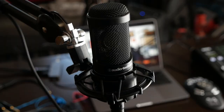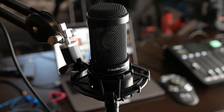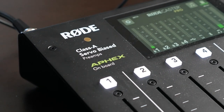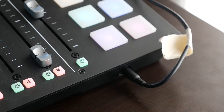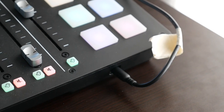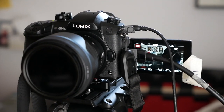To give you an overview of my setup: I'm using an Audio-Technica 2035, going into the Rode Caster via XLR. The first thing I tried to get audio from the Rode Caster to the camera was probably the most logical first step — I used the 3.5 millimeter output on the front of the Rode Caster and just used a cable to plug it directly into the mic input of my GH5. And that's when I got this horrifying sound.